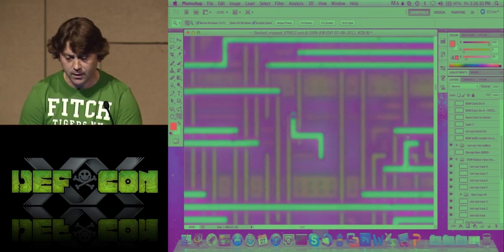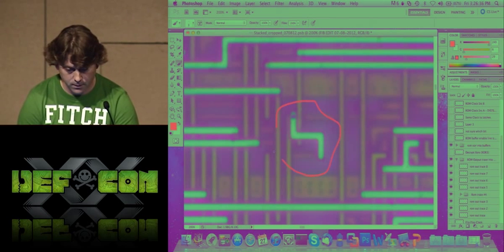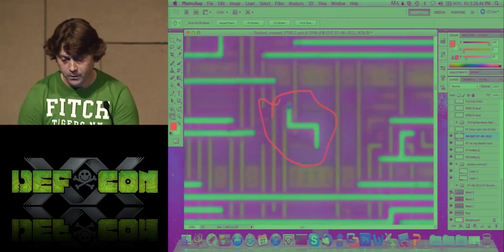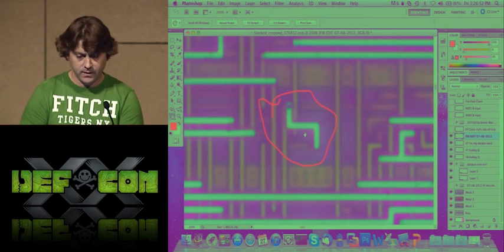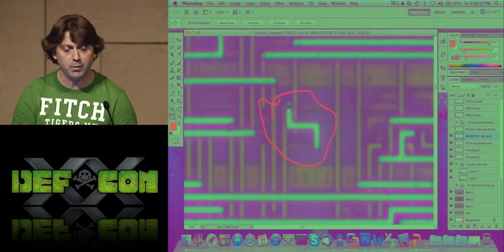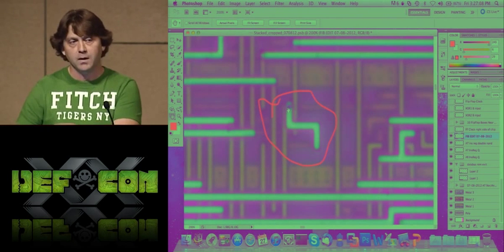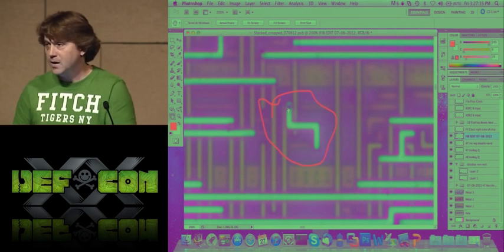So in this picture, in the middle of the view right here where my mouse is, that is an example of a bogus gate. This gate has no purpose in life whatsoever. I don't even know what it is. Let's see what it is. This right here used to come to the surface, to the finger of ground. That little black dot is what's left of the via that had been there before I polished. So this has been polished until the aluminum became nice and white. This way I don't have to sputter coat it if I put it in a SEM or a focused ion beam workstation. You should sputter coat, but I'm lazy, and so I didn't. But I could have, and I should have.